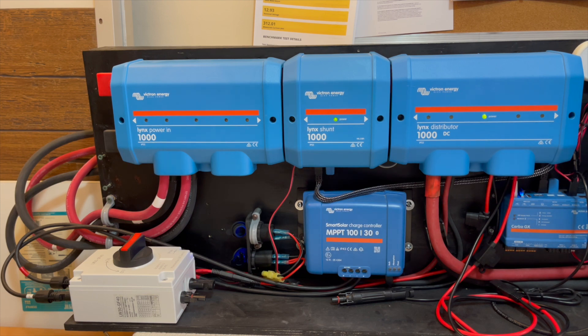I installed this switch at the bottom because I have an outside cable outlet going out, and when not in use — just in case water gets in or someone plays with the connectors or tries to short it out — having that turned off when the unit is not in use acts as protection. It also allows me to disconnect the solar array when moving it around. It's a safety feature, and it worked quite well on our last trip.